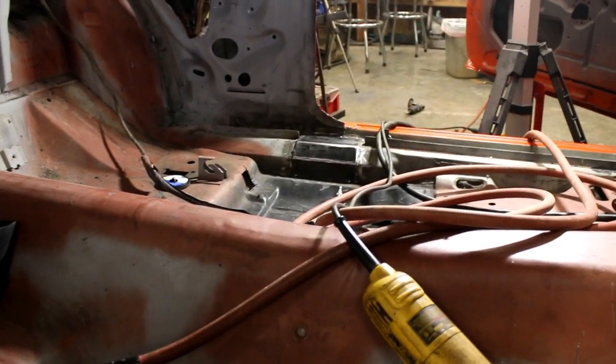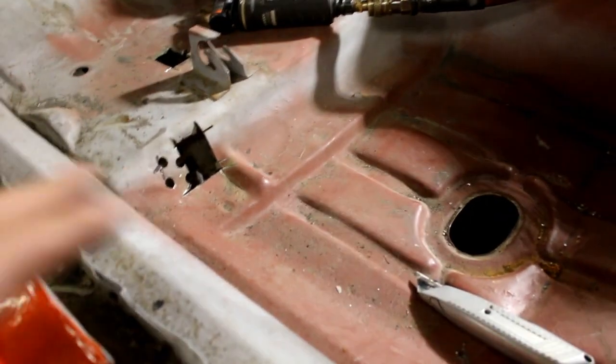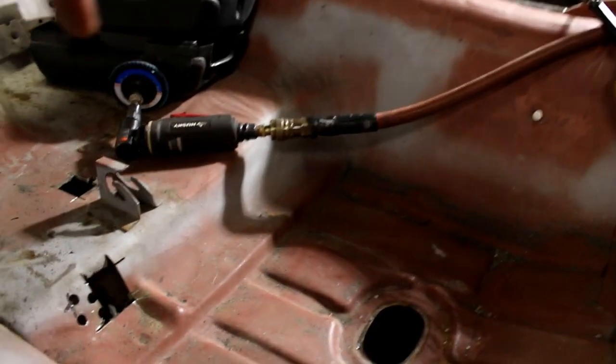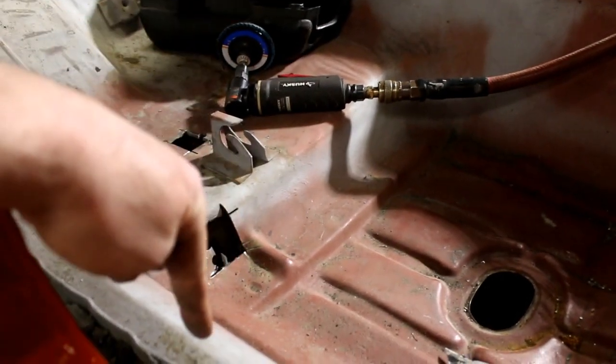You know, I don't actually even know if you have to fully weld these plates in or not. I like the idea of doing that just for rigidity. But if you're just through bolting it, heck, you'd be actually weakening it. So a lot of it's just to make sure the plate doesn't lift off. It can't come off because the roll bar is going to mount or weld right to that plate, those plates.